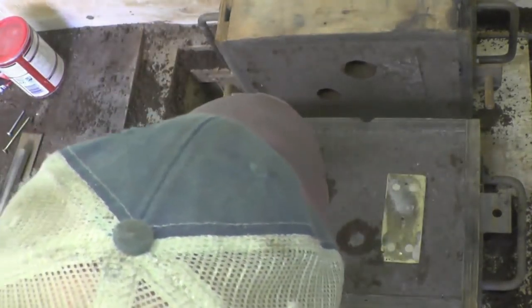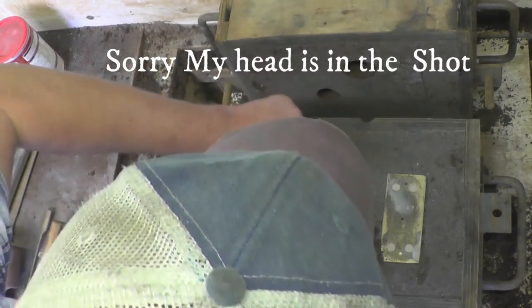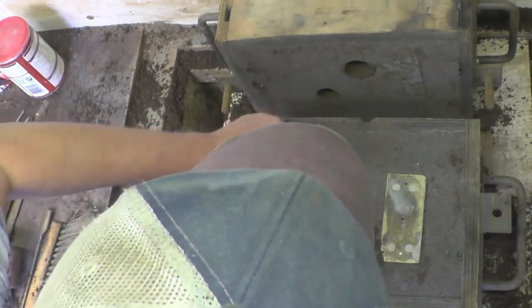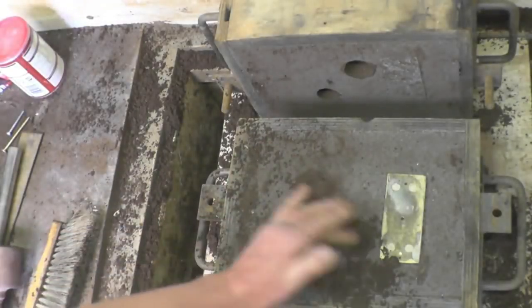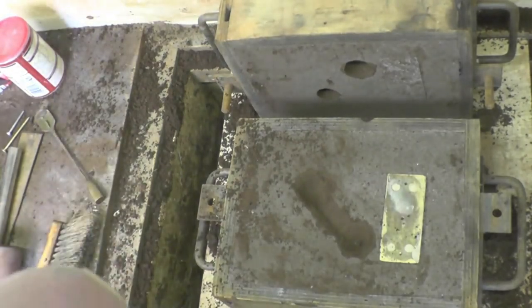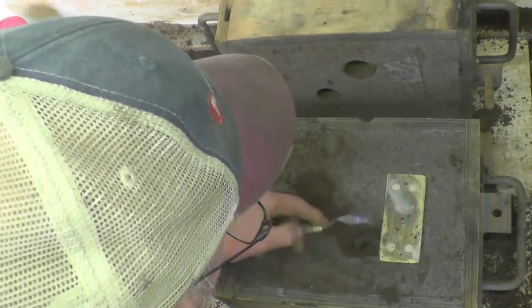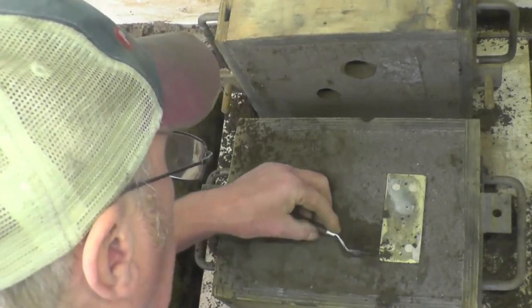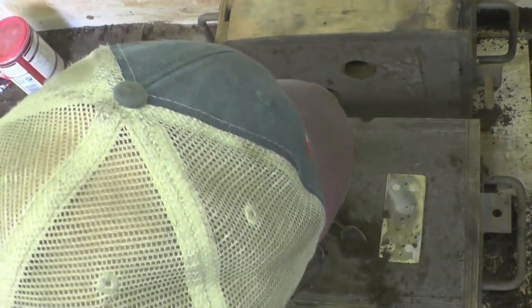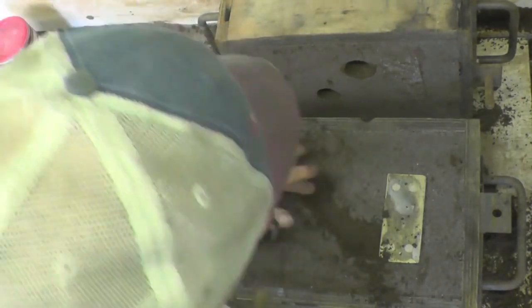Right, so the metal comes down here — we need to form a basin so any shite or dross gets caught in there. That should about do it — that looks good. Right, finally we need to be able to get the metal from the riser into the actual part — that's called a gate. Nice big wide gate, because there's quite a lot of metal going through there and we don't want it cooling off and freezing up. I'll trim that up once I get the pattern out — it's not too bad.